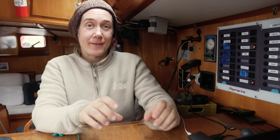And then the final thing: with this amount of electricity that it uses, the wiring that came with the heater wasn't really that thick. So I would advise that if you have a longer wiring run, you cut the wires close to the heater and replace them with something a little bit thicker. That's what I did personally.